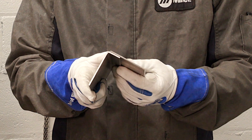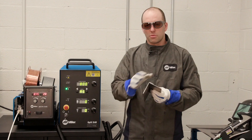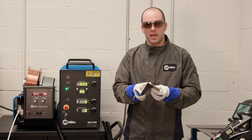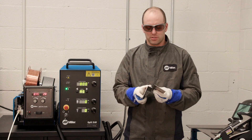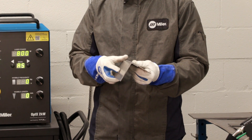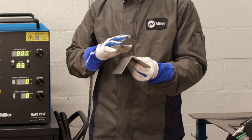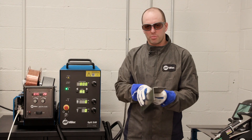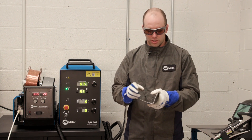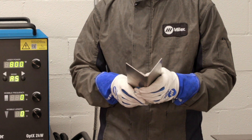You can either do an inside configuration or wrap and put that on the outside. By doing this type of configuration you have a little more flexibility as to how those parts align to help you achieve the dimensional tolerances you're looking for. You may want to run a continuous weld down the entire outside for aesthetic purposes, or if you're welding cabinets and just looking for quick structure, doing intermittent welds on the inside — these are both great ways to accomplish that.